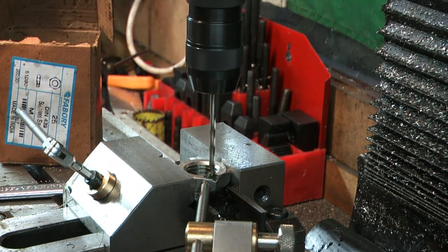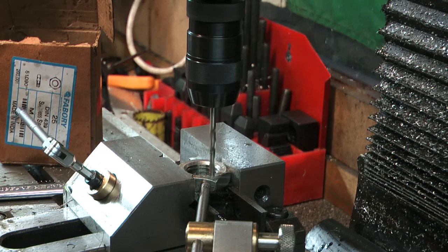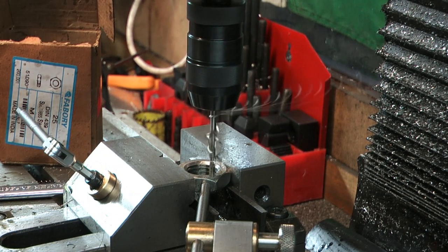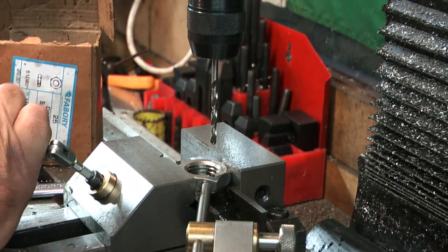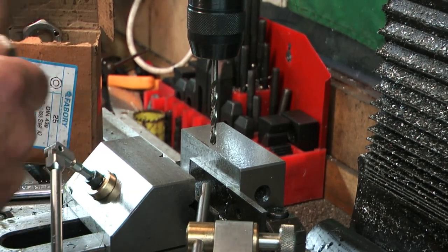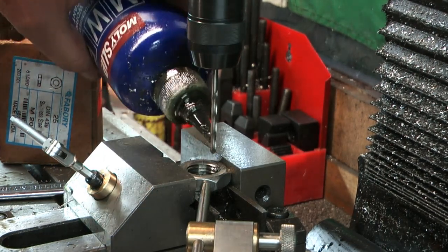3.6 millimeter hole down through. So in a different orientation to the original tapped hole, this is just a hole. 3.6 mil diameter. I find when I get so deep, if I fill the hole up with my fluid, I get a nice breakthrough the other side. I think I'm at about 25, 27 in now. So pop that one out in the box, grab another, get rid of the loose swarf that's still on it from tapping it. These will be cleaned before the next op. Okay, and rinse and repeat.